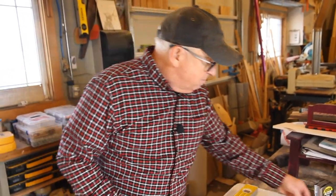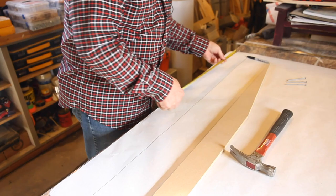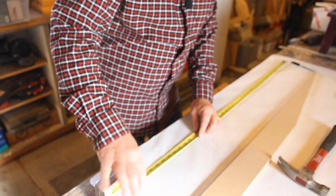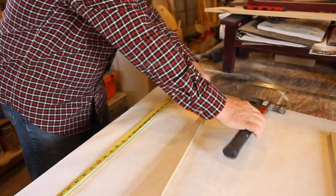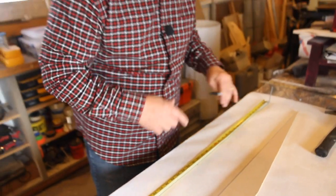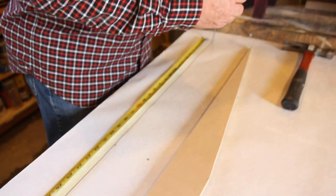Just like we did on the other method, I'm gonna draw a baseline across the bottom here. I'm just drawing it wild to begin with, and a portion of this will be our bottom half of the arc. I'm in excess of 42 inches so we're gonna be fine. I'm gonna put down two nails — one at the 42 inch mark, one at the zero — and put another mark at the halfway point between zero and 42, which is 21. I'm gonna place the taper board on top and extend the mark out to show where three inches is, and put another nail out there.